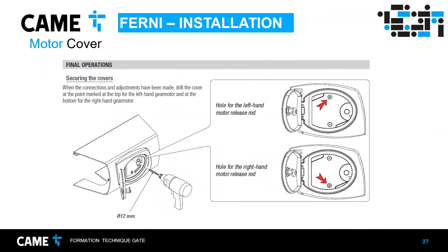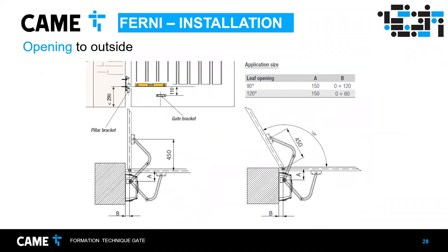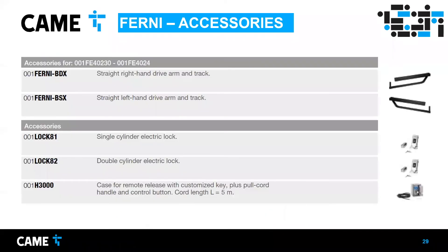You connect the wiring through either the bottom or upper hole depending on which side is installed. For gates that open outward, you install the operator on the inside using these measurements as guidance. There's also an accessory — specifically a sliding arm, available for the left and right side — for cases where there's an obstruction preventing the articulated arm from swinging freely when opening. This accessory prevents the arm from hitting the obstruction, such as a wall.